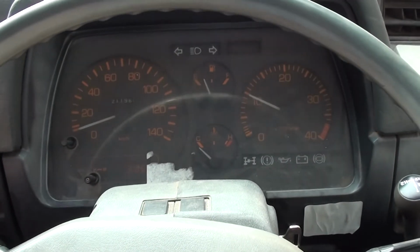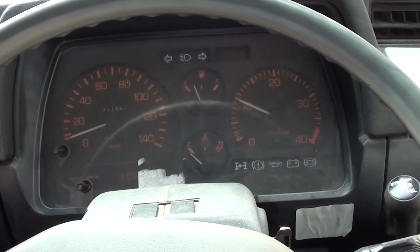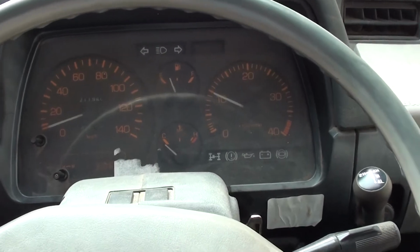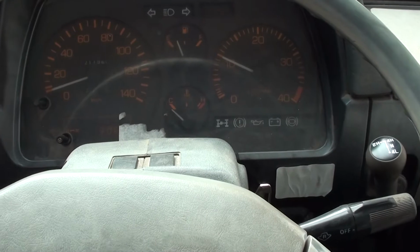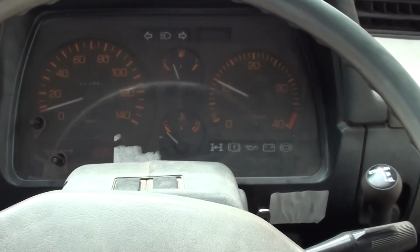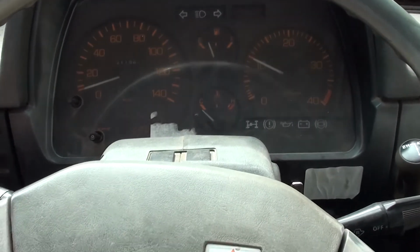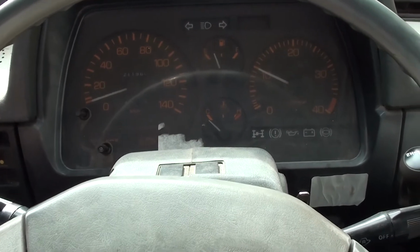And go and check the air pressure in the tyres, because they state 107 PSI is normal as a cold temperature, and I don't think they've got that in them. The front ones have got bulges in them with no load on, so that's a bad sign when you're talking truck tyres, because they're an off-roady style pattern. They'll be causing a significant amount of drag. So we'll go through and check all of them if the air gun at the servo goes high enough. If not, we might have to do it at home. Let's go for a drive and see if it's any different.